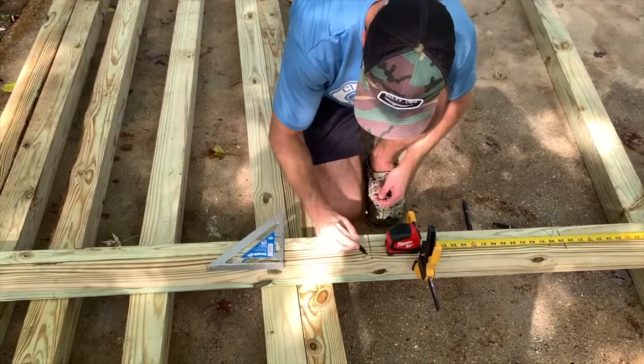I needed two pieces of drip edge to span the total distance, so I created that bent corner piece just like we did on the other side, and then you're gonna overlap the second piece of drip edge with the first drip edge by a minimum of 6 inches. Typically, you can get two pieces of drip edge to nest together pretty well by tapping it with a hammer. As you can see, I had the corner up flush, and then once everything was good and I had that 6-inch overlap, I nailed everything in place every 12 inches on center or so. As you can see, I have the bent portion there that looks good. And just like the other side, I'm gonna install a nail to make sure that that bent portion stays locked in place.